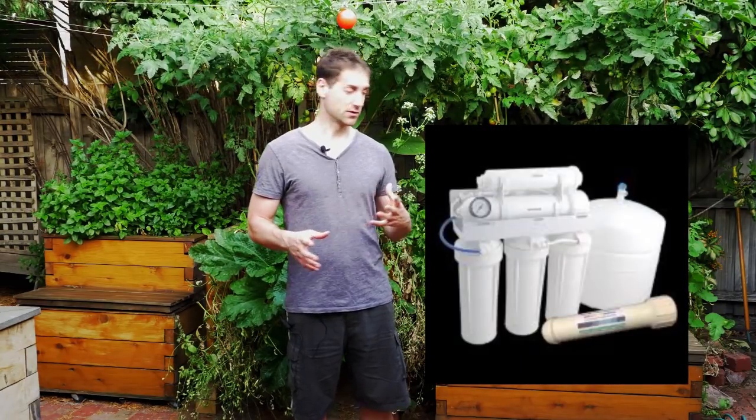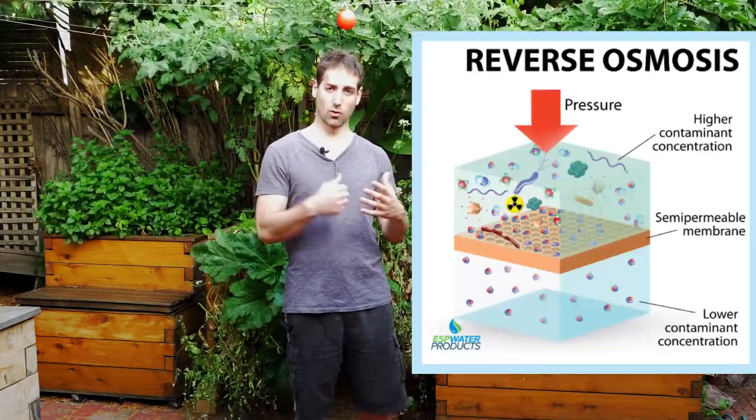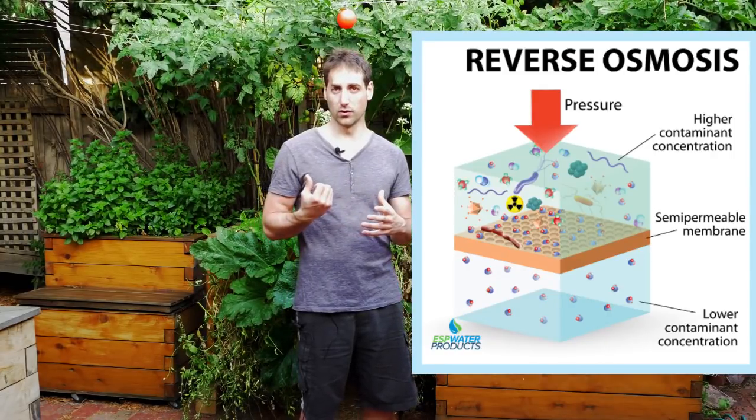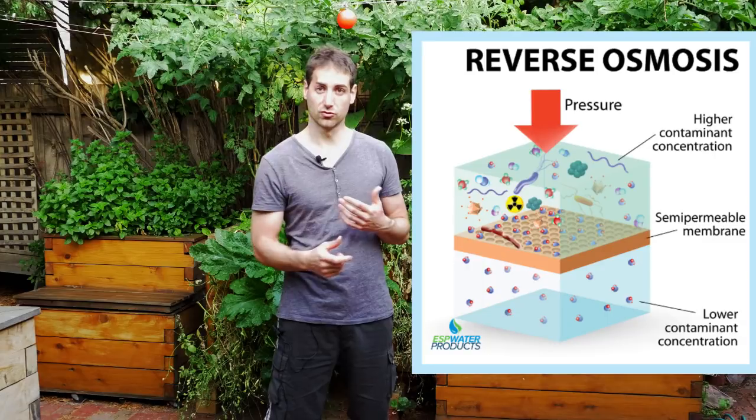One of the very famous ways is to use an osmotic filter — we call it reverse osmosis. It's a filter that pushes the water through a membrane, retaining all the solids and minerals in the water so that only the water molecules pass through. You have one inlet pipe and two outlets: one for the purified water you want to use, and another for waste water. You can use the waste water for your toilets, but most of the time it is completely wasted — that's why I don't really like those filters. They also use a bit of electricity, so it's not really a passive system in terms of water consumption and energy.